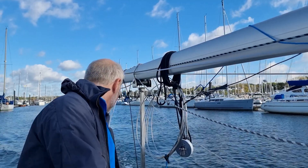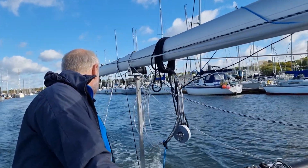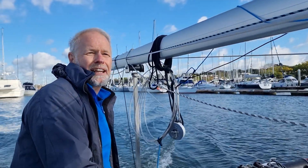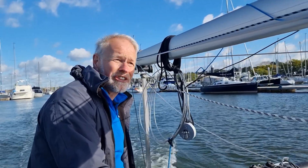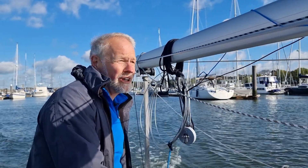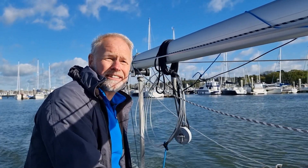So we're doing about 5.2 knots at 1300 watts right now. Just over 2000 watts and we're at about six knots now, which frankly most monohullers would be very, very pleased to achieve in any conditions on their engine. So we're only using two thirds of the power available to us. I'm going to slow it down because we are exceeding the speed limit. And that's all in all a very effective little test.